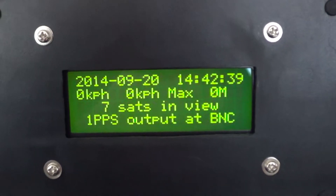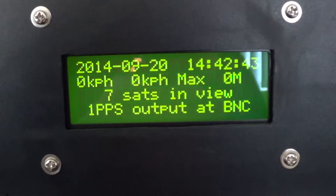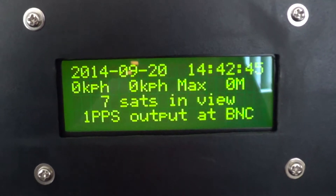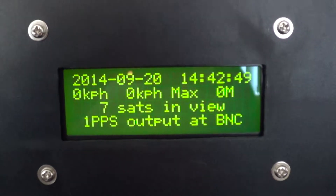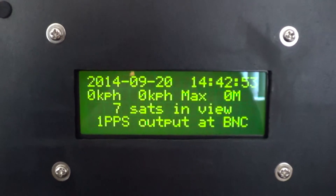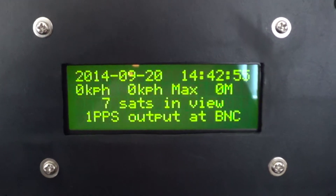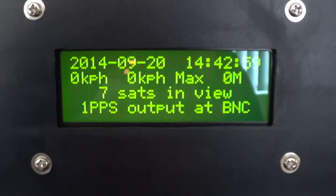When you code your PIC or your microcontroller, you want to be using a quartz crystal around 10 megahertz to have a nice stable 9.6 kilobaud. The other option is to use a hardware serial port to communicate with the GPS receiver. But again, for the price, really good value.